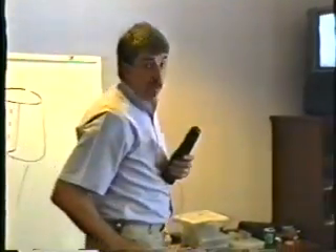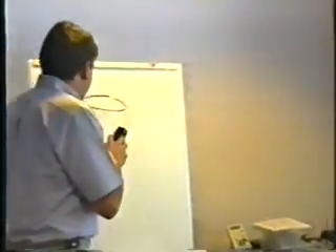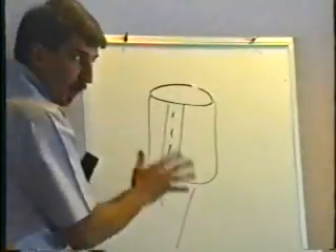That's so you can identify the capacitor from the bottom of the board. When you have it mounted on a board, you can look at the bottom and see which side is the positive end and the negative end. And that's really important because if you connect the capacitor backwards, it will blow up.